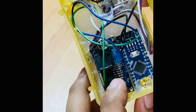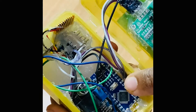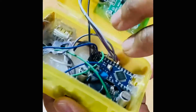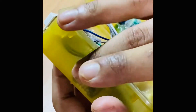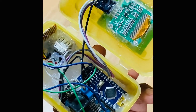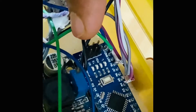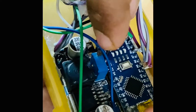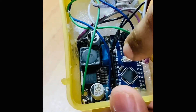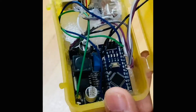Beside the Arduino Nano is a voltage booster board. Initially I thought the Arduino Nano could run off five volts from the power bank, but the display as well as the MAX30102 sensor also need five volts, so when it started recording readings it would just shut off. After googling, I found that nine to twelve volts is recommended on the VIN pin. The VIN and ground pins are connected via green and blue wires to the output of the voltage booster board, which is set at 10.5 to 11 volts — stepping up from the 5V power bank output.